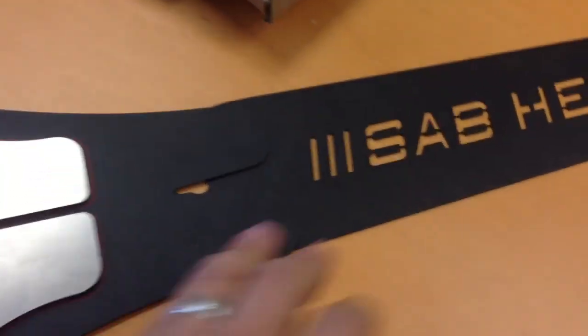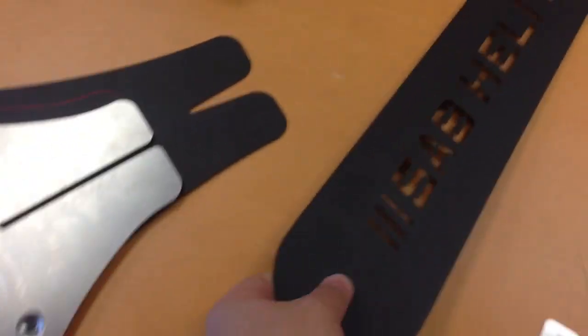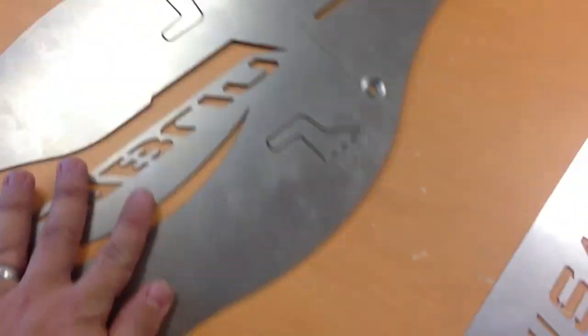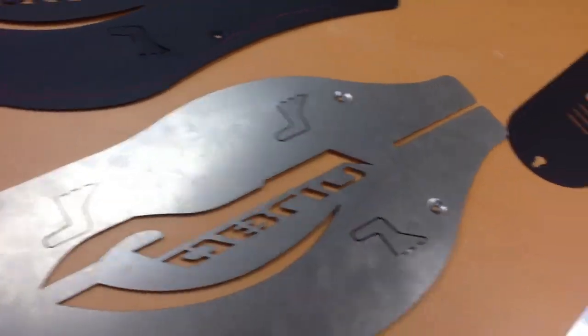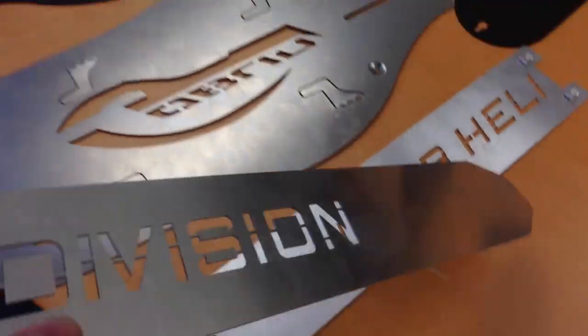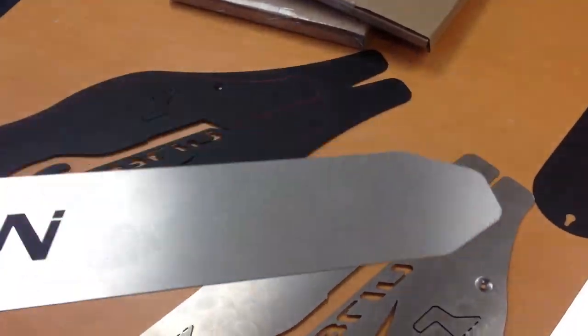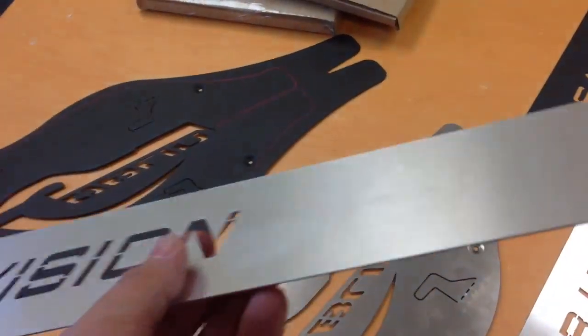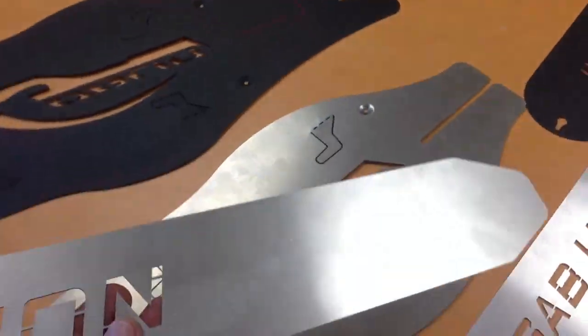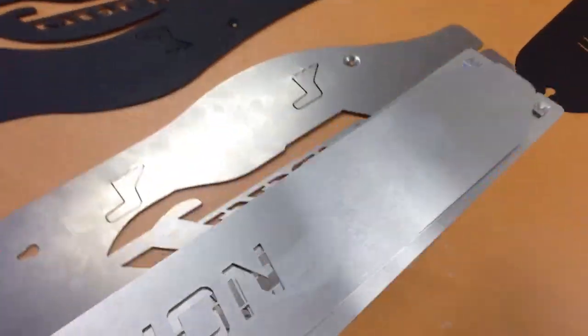The original profile I had made into two pieces, primarily so that when laid like this, they were both the same length and could ship in a box. To make it easier on shipping, what I've done with the new one, again, kept this from steel, but I've made the tail boom now out of two pieces. These are made out of very lightweight aluminum. Cost me a little bit more in material cost, but the shipping costs more than make up for it, and makes it much better in shipping. You can save quite a bit of weight just by going to aluminum here.